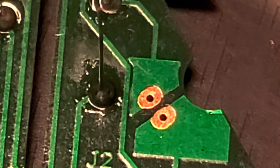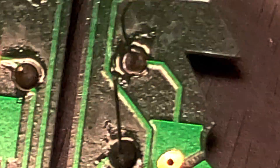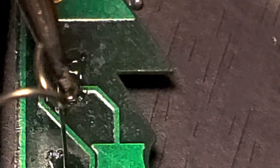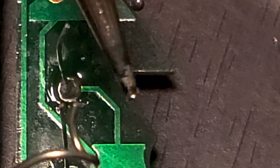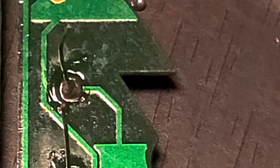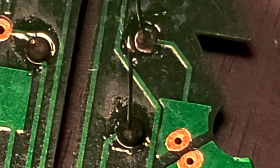I hope that was a good lesson for you. Also, apparently if the soldering iron is too hot, it will drive the flux out of the solder before you can actually do anything, so you don't want it to be too hot either. Right now mine is at 300 degrees Celsius. Cheers, Merry Christmas, or Happy Day, Happy Evening, Happy Morning!